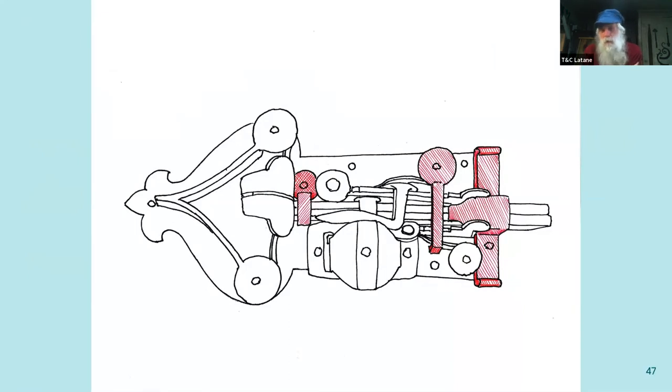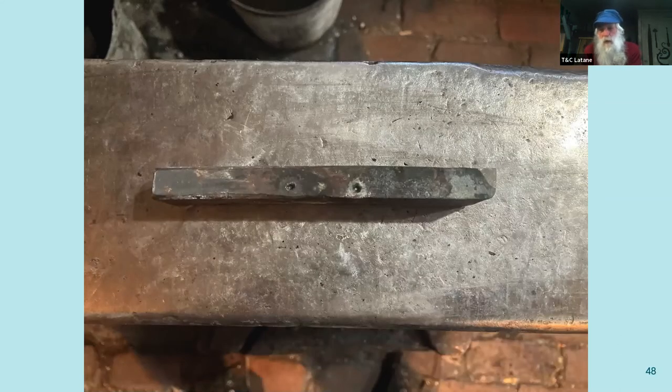Here is the drawing of the staple to be forged, just like the one on the right shown in red — it has that extension off to the side. A modern approach might be to cut this out of a plate and then bend it up, but from watching historical blacksmithing practice, they would more often start with square or thicker material and spread or draw parts down. If you cut this from wrought iron, you'd have short grain on that little tab and it would be more likely to break off. Pinching it out from the center of a bigger piece means the grain follows the shape, making it stronger. The starting piece of scrap was estimated to be something under half inch by one inch, marked off an inch in the center, likely just under five inches long. A near-side shoulder was done on the far center punch mark, so what will be the extension in the center is to the left of that shoulder and everything narrower on the right will be one leg.